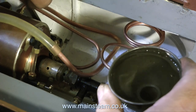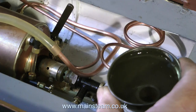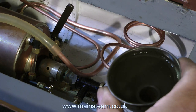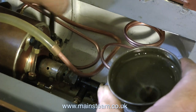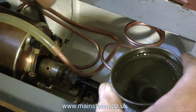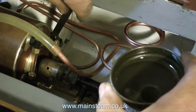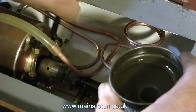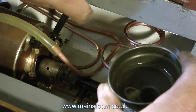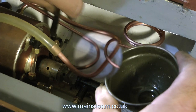There are no leaks, which is always a good thing, and no blocked pipes, which is even better. It's very easy when silver soldering to block up the pipe with silver solder, and I've done this many times — especially on the very small capillary tubing that you would use for things such as a pressure gauge, and more so on water gauge blowdown valve extensions. This pipe is usually very fine. I'll just speed up this last piece of video so you can clearly see the water disappearing down into the hole in the bottom of the funnel.